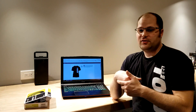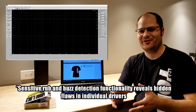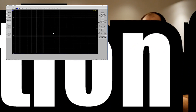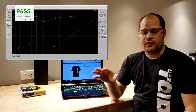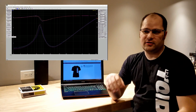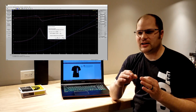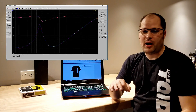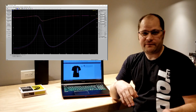The first thing DATS V2 can do is a rub and buzz test, which tells you if your speaker is good or not. You probably do need that — here's why: if you get really into speaker building, you're going to buy drivers on sale with every intention of using them right away, and then six months later you haven't opened them. So the best thing is to test them when you buy them so you know if you have a good driver without having to build your entire system. It also tests the values of capacitors, inductors, and resistors, and gives you your impedance graph.